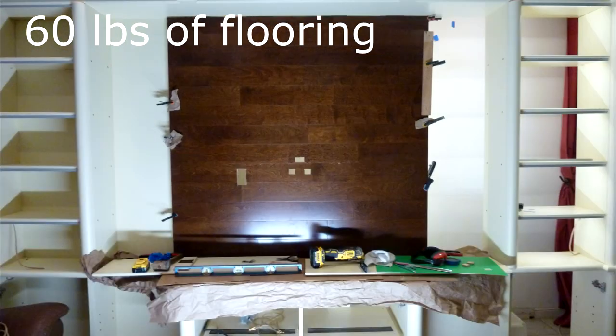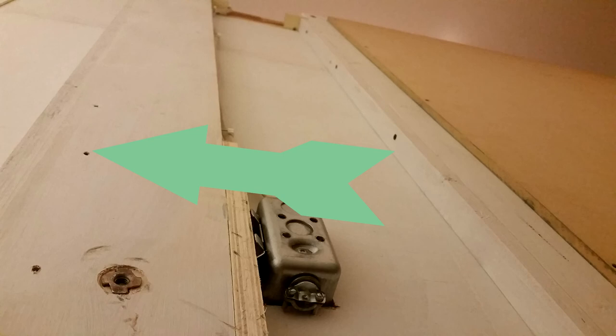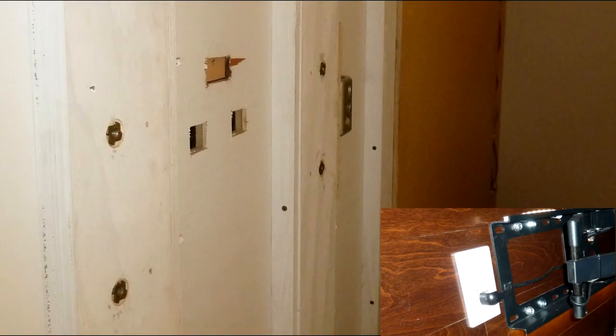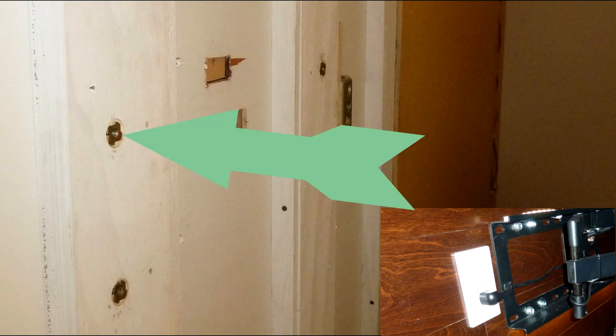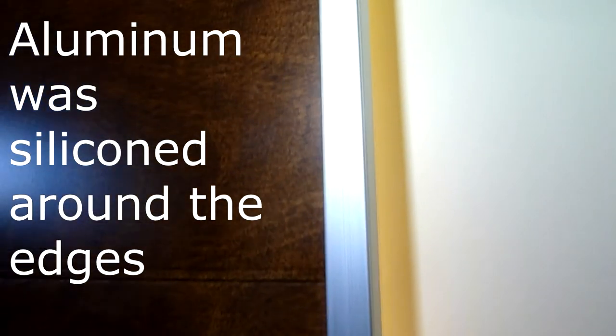After it had dried, I went ahead and cut the holes out in the back that I'd previously cut, which were all aligned with the TV bracket. To locate placement on the TV bracket, I simply drilled through the holes that I'd created in the test mount. In the final solution, I used two lag bolts, top and bottom on each side, and then put in two T-nuts to ensure it would never detach from the beam. I thought it might be cool at some future date to install some hanging pictures or something along the faux wall.